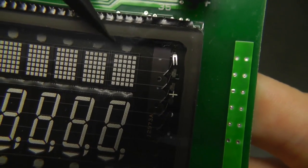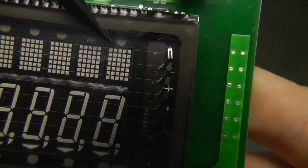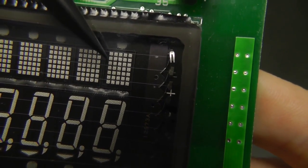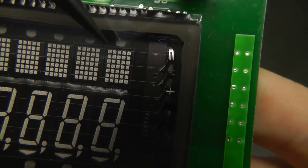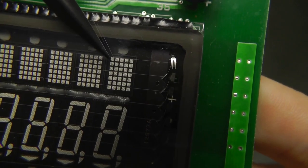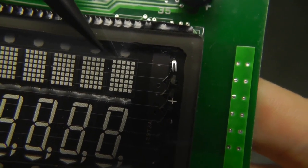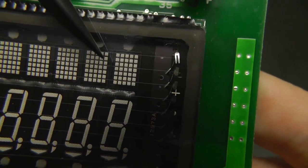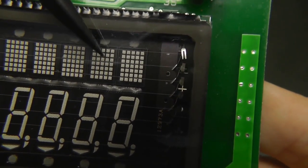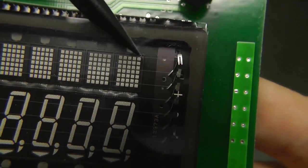But what's even more interesting than just blocking is that if you power them, and if you control the power, you can make the electrons fly even faster and hit the anode with more force. And this way the anode will glow even better, because the electrons are hitting it faster or with more force. And that's why you have this grid.